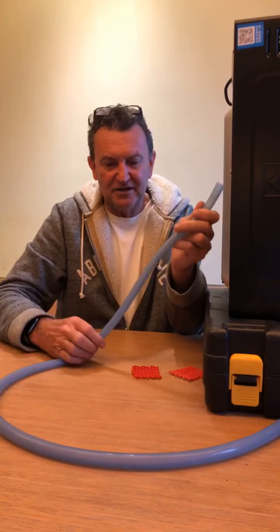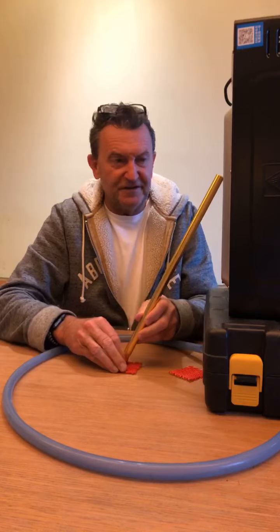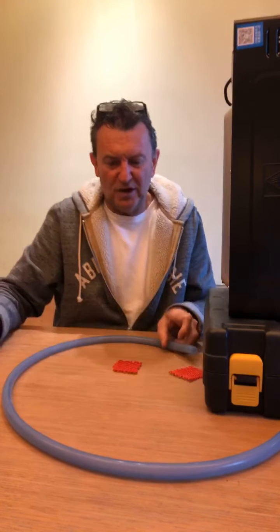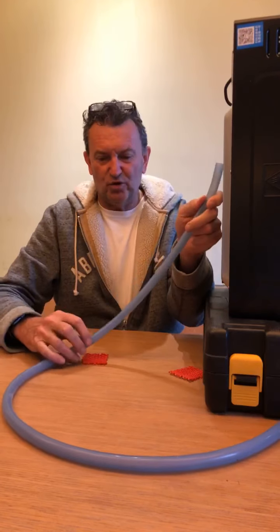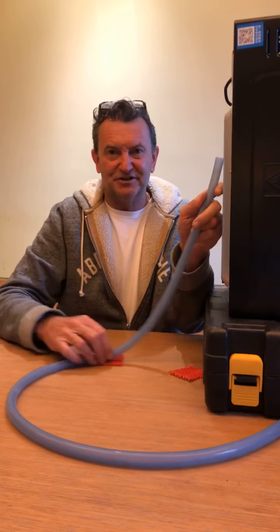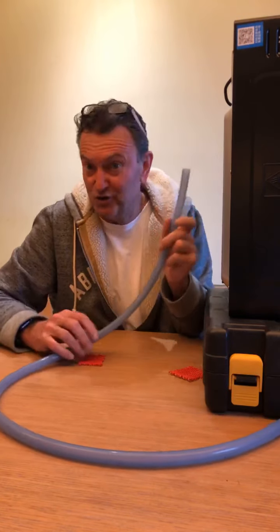When you have a straight line, I walk 3 feet this way, the brush goes 3 feet that way. But if you have a flexing pole, I walk 3 feet this way, maybe the brush goes 2 feet that way, and the rest is lost in the flex, right? So don't think there's no way to use flex, right?